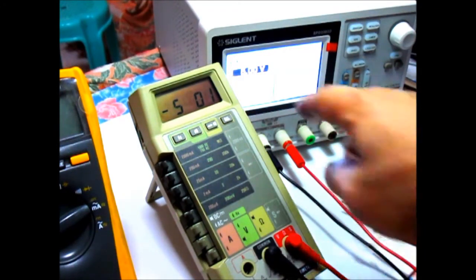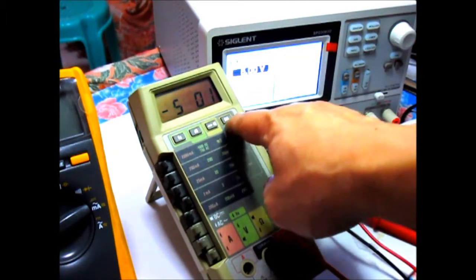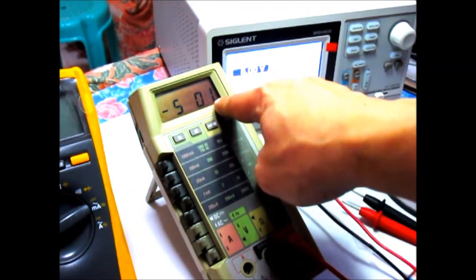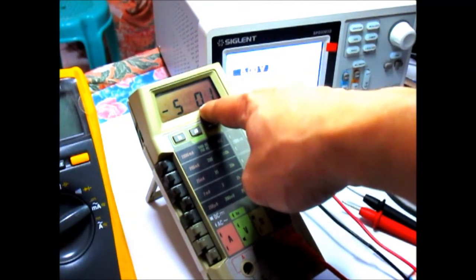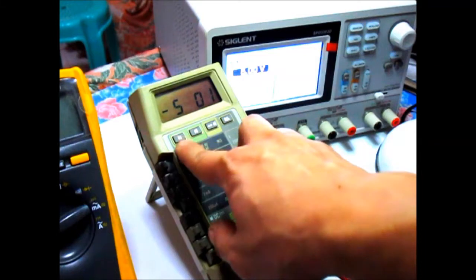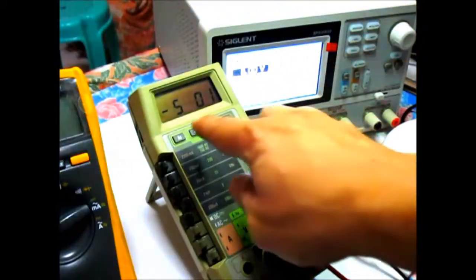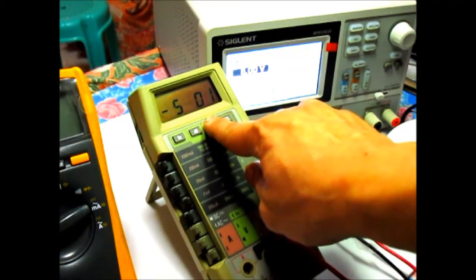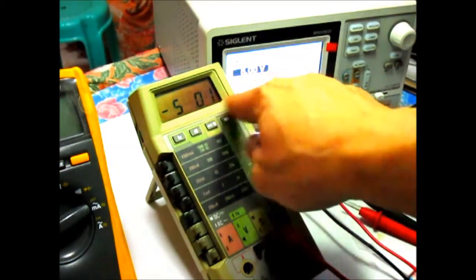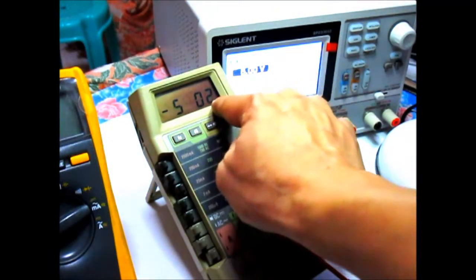For this test, each digit corresponds to a button. Like for this digit, the second one, this corresponds to these 4 buttons right here, depending on what is pressed. If you press this button, this should display 8 right here. So it's the second part of the button. This is 8, 4, 2, 1, and if none is pressed, that's 0. So that's working fine.